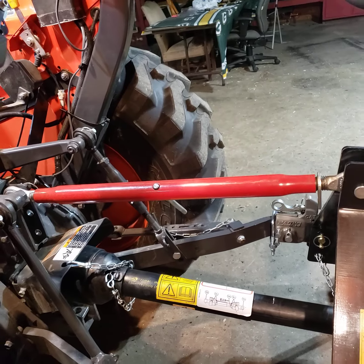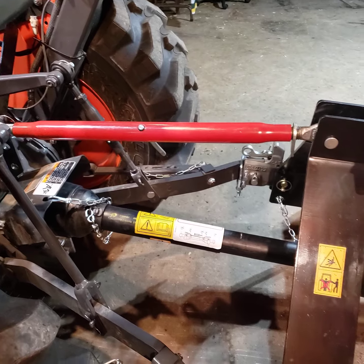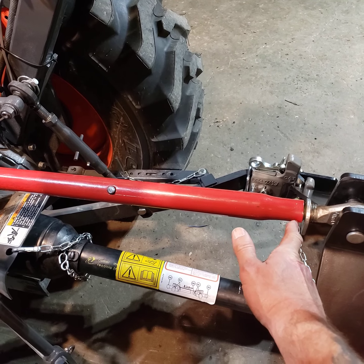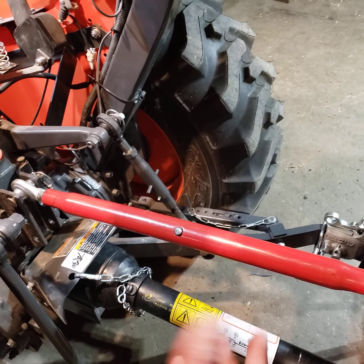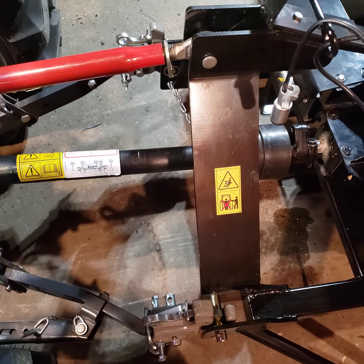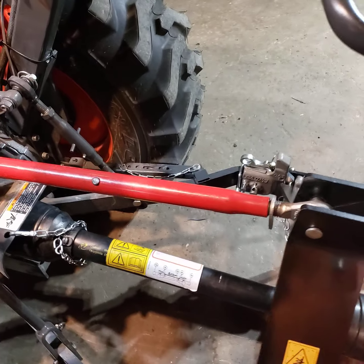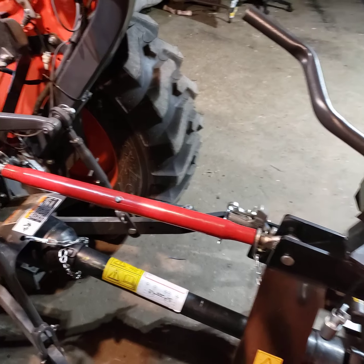Made me get my 24-inch monster top link, because the 16-inch that comes with the L2501 and it's the body. So from here to that point up there, this is 24 inches. The standard's 16. Pat's moves it out 4 inches. So this is a little long. It's good here, but as you can see, I can't shorten it up much. I think a 20-inch body'd be perfect.